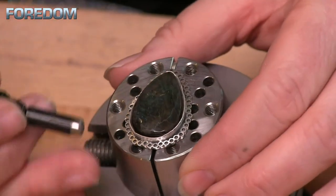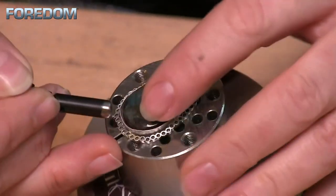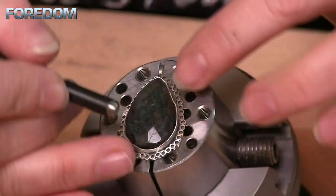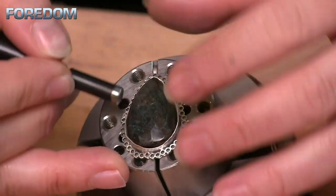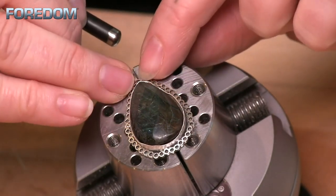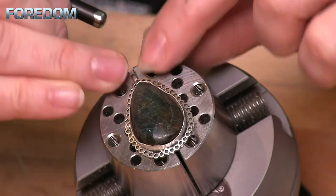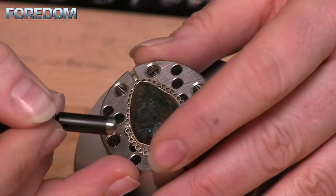Notice that I'm going really slow here. Some people choose to go really fast, and you can — there's no right or wrong on that; it's just what you prefer. I like to make certain that I stay in good control as I'm doing this. Now that I've got multiple points set, my stone has no rocking and no moving. Now I can just start to bring this along. I like to work away from a point, and I always set that point very first. Anytime I have a point, if I were to bring this to the point, I'm going to bring too much metal up here and it's going to be really hard — I won't be able to get that to lay down nice and smooth around that point. Always set your corners first.